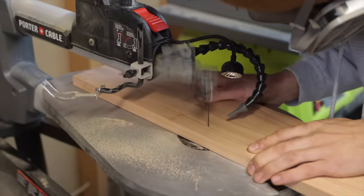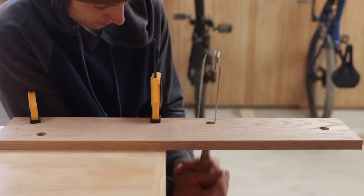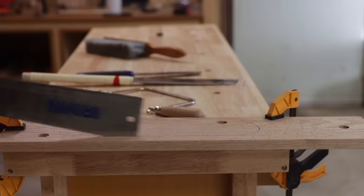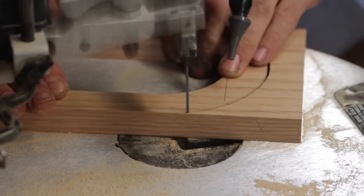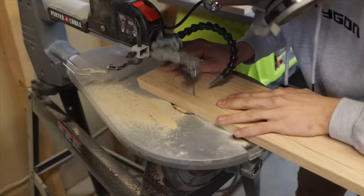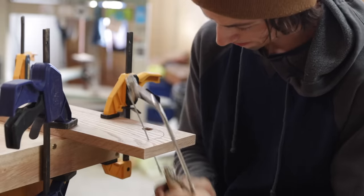If you're using oak like I am, you're going to need a good blade on a jigsaw, coping saw, or scroll saw to make these cuts. I highly recommend a hardwood for this project because you're putting a lot of weight on the front of the rack every time you take your bike on and off. With the power tools I used a scroll saw for all the cuts, and with hand tools I used a ripping saw for the straight sections and a coping saw for the turns.